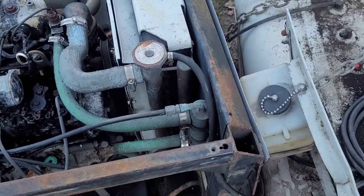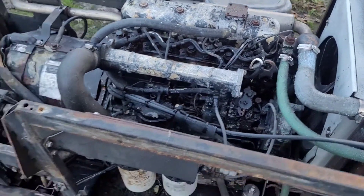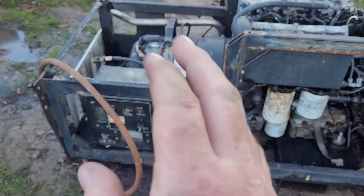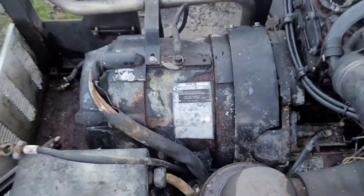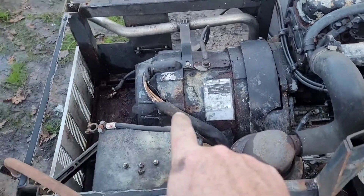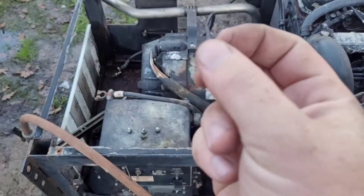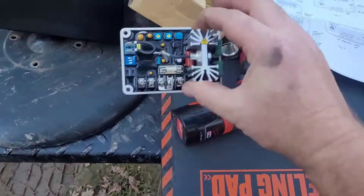I forgot to mention it has a fuel heater on it — I've never seen one of those before. I need to get an oil filter because it has a pinhole in it. Right now it's set up for three-phase 480V. Since it's a 12-wire lead alternator, we could restrap this down to 120/240V. It has a big honking voltage regulator in there — transformer type, or mechanical voltage regulator — that I'm going to replace.